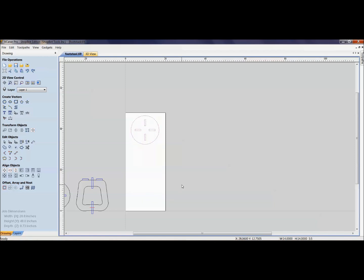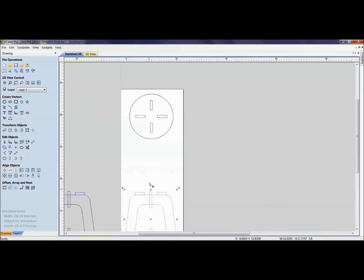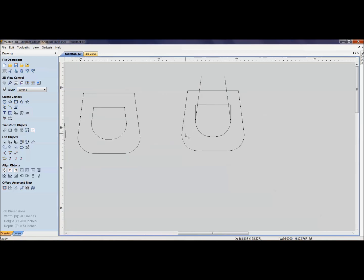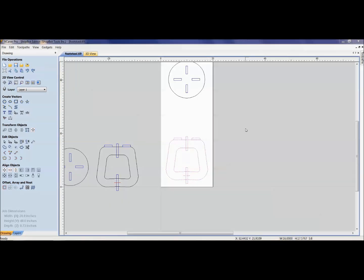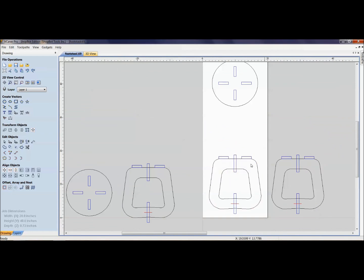For the two sides — the slotted parts — I leave the originals and work on copies. I even keep originals further back in 'no man's land' as I work through stages: starting shapes, adding arcs, fillets, angles, then adding tenons. If you go too far down a path you don't like, you can always come back to an earlier version. It's optional but something I prefer to do.